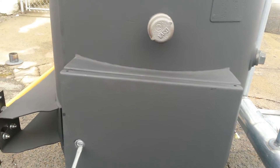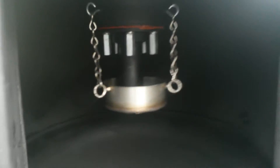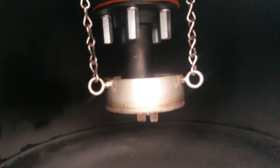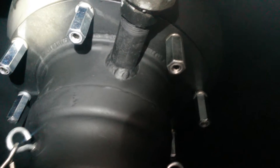I have all the rope gaskets done, and now I'm going to show you the inside. You can see the extension is done on the reduction zone, and I have all of the threads with anti-seize. I'm going to show you the output — you can see I have all these coupling nuts capped off so nothing can get on the threads.